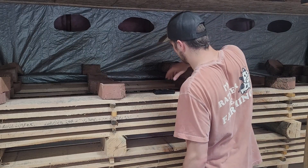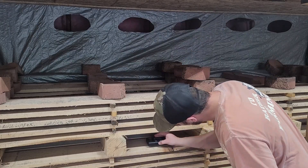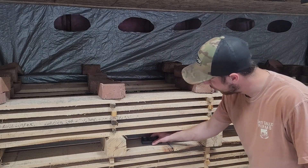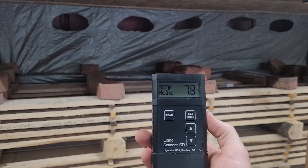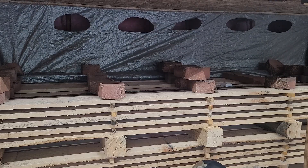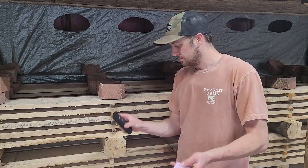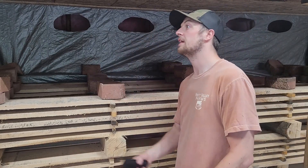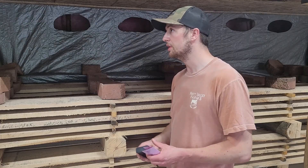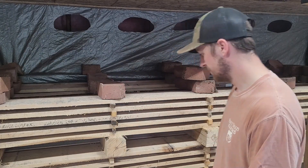Reading 8.8%... 8.2%... I'm going to hit hold so it'll hold the value. 7.8%... 5.8%. So all in all, I'm pretty happy with where everything's at — anywhere from 6% to 8.5%, which is pretty good for drying wood to work with. Building this kiln has taken the drying time from one to two years down to about three to four weeks, which is really cool.